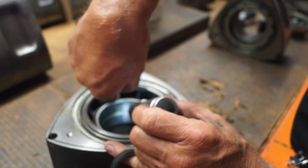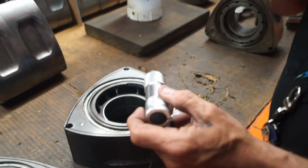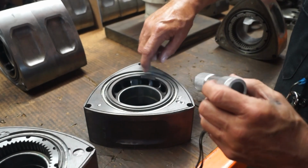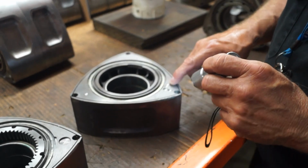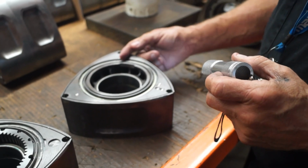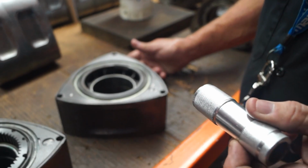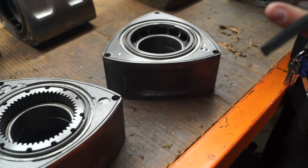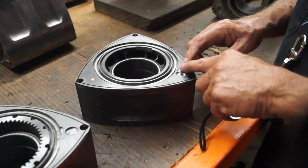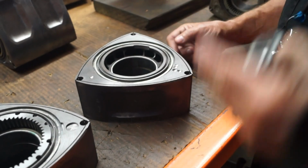So I came in here and just went like that, took a swing, probably had it on and off several times until I got close enough to be able to do some final correction. And then the final correction was done by taking a little bit off over here and then finishing it off with these 4 spots. With the ball, that depth, I may have moved that weight over a total of 0.3 grams, possibly, maybe 4, no more than that. So once you get your gross amount removed, the final touches were basically done by hand. And it required these 4 little kisses here and this one here. Like I said, both of these rotors are at 0.12, 13, something in that range.